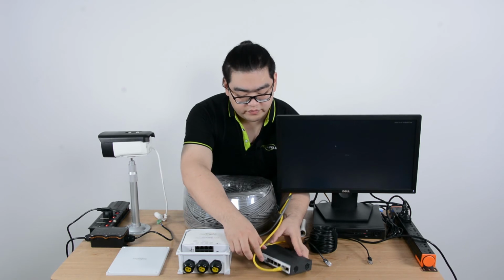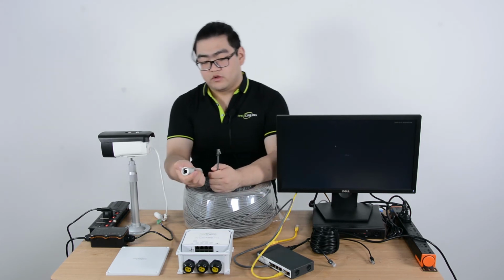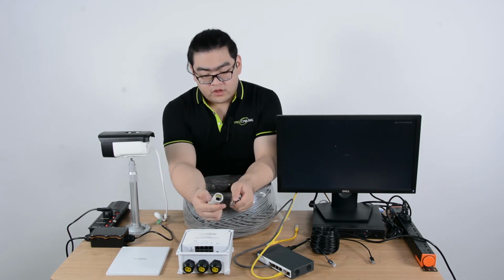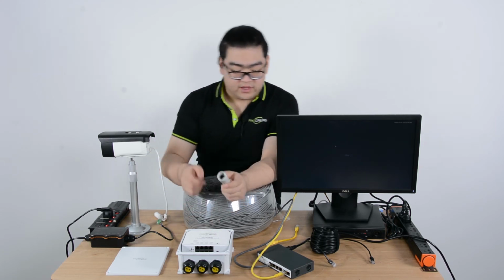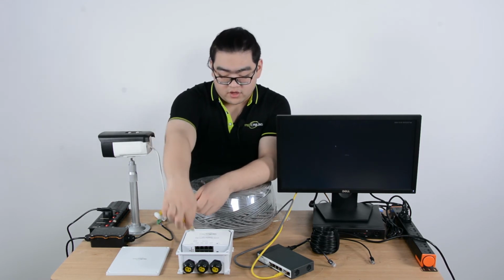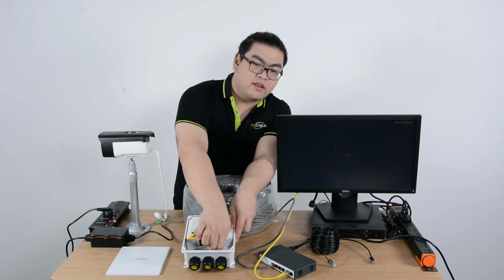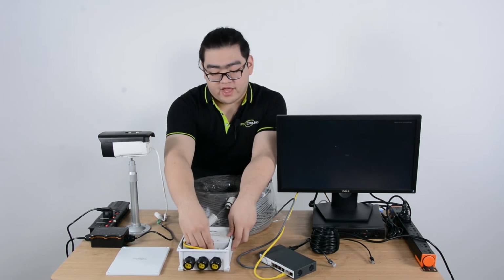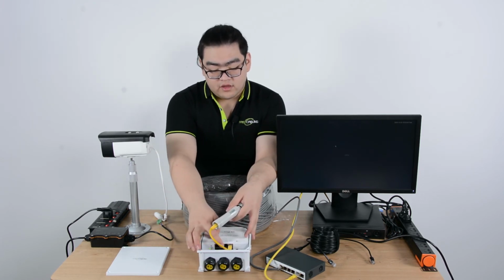Now I've connected here. On the other side, the corresponding chip I mentioned exists in this PoE extender, which is also an adapter. The signal goes to the input port and then comes out the output port. We'll use a short patch cable here and then connect to our PoE-powered switch. That goes to port number 8, because in any powered switch, port number 8 is the one that receives the power and data, then divides it to all 7 other ports. And now we can see that the indicators are on.